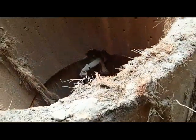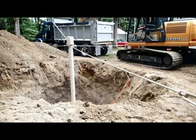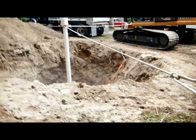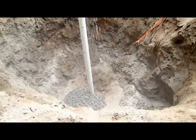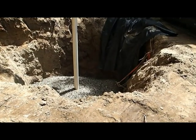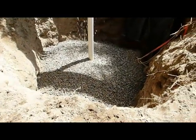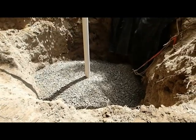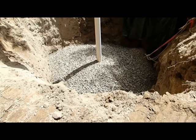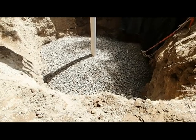This is the process of tying off to three points. We're adding stone after the casing has been plumbed — you can see the holes in the casing. We're adding the second load of stone now, up above the holes, adding more and more storage. The original well had very little storage and the homeowner would run out of water. Each load of stone should be about a thousand gallons, so with two wheeler loads — about 25 yards — that should give them almost two thousand gallons of water in storage.